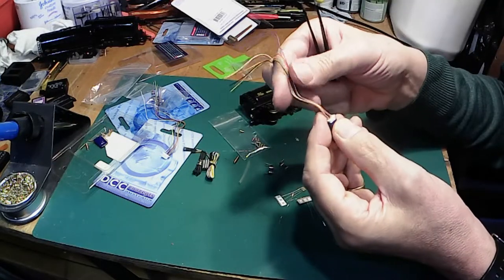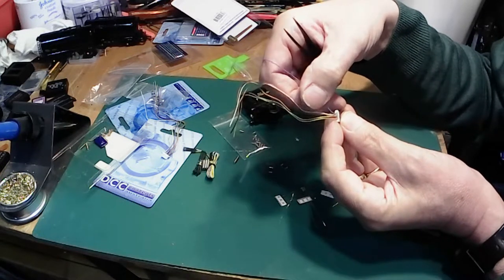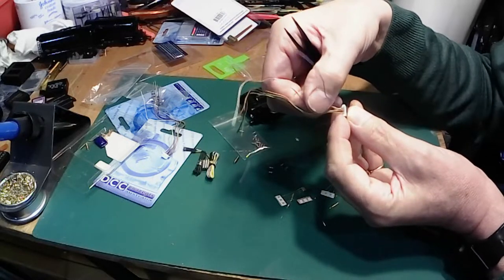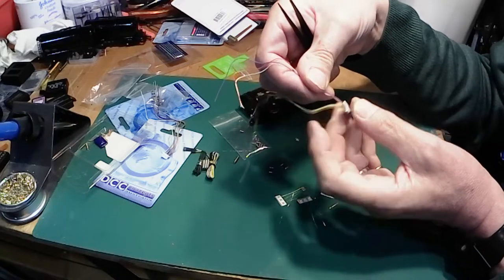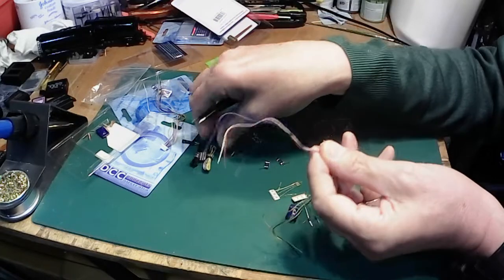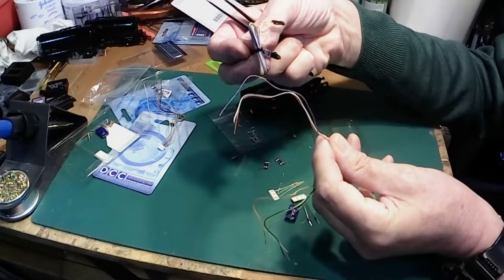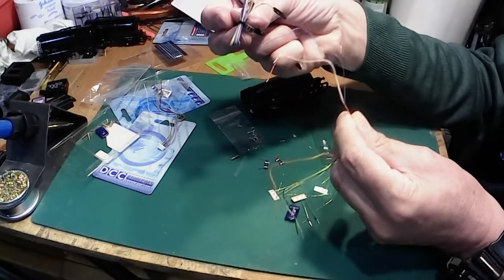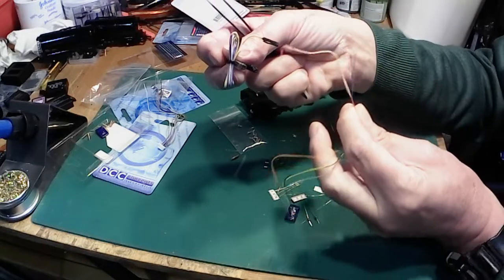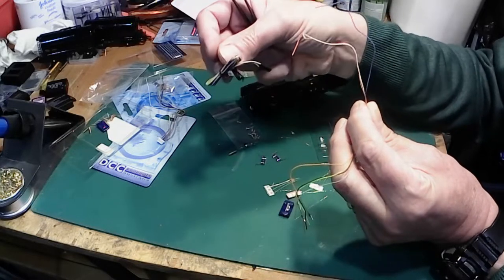Now, lots of wires. But the first three wires, which is a white, a purple, and I think it's an orange or maybe a red, take that off. That would go to the hall switch, because they've actually got the same colours. So you can't go wrong with the colour combination. On the end of the three wires there, a yellow, a white and a purple, you would end up joining them all together if you desire to have the hall switch operation.